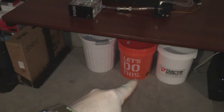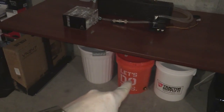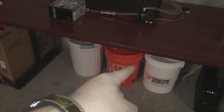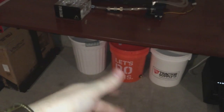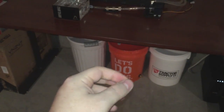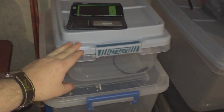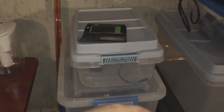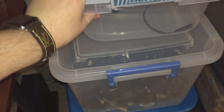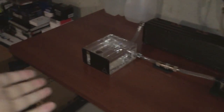Previously it was this — I just used a giant bucket and drilled a fitting in there and used JB Weld to seal it. This worked for a long time, but inside the bucket I was noticing the JB Weld was not looking super perfect. There were like one or two little flakes that were loose and ready to come off, so I figured it was time to replace it. I then tried drilling fittings into the side of another bucket, but the water sealant doesn't bode well for a flexible bucket. So I decided to go with an acrylic reservoir.